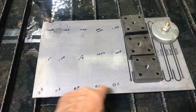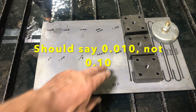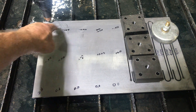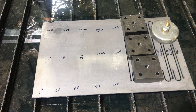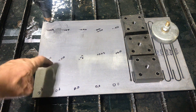I assumed zero was always at the start and then let it traverse. In the middle it's about 10 thousandths high, and over here it's about 10 thousandths low — that stays pretty consistent. Out in this corner instead of being about minus 10 thousandths it goes minus 7 thousandths, so minus 3 thousandths. So here it's pretty close to where we started, although it went up 11 thousandths in the middle.